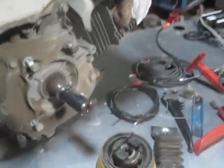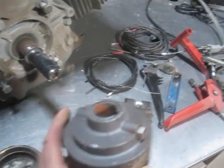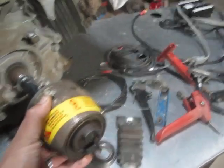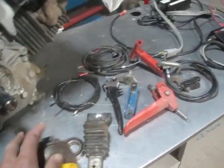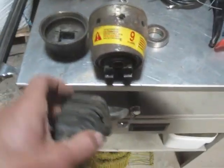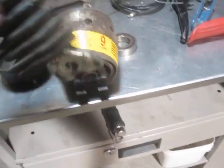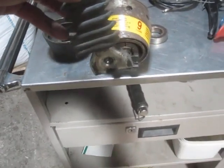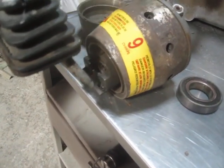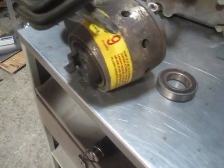The Honda motor typically has this BCS clutch bolted directly onto it and then that assembly gets mounted into the bell housing on the front of the tractor. This is the clutch throwout fork — when you pull on the clutch cable it pushes the center part of the clutch in and the Belleville springs give a little bit. It's some very robust spring.